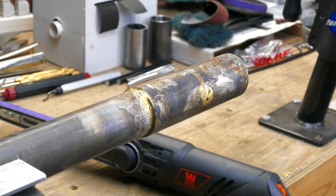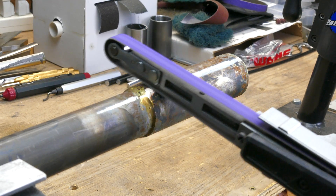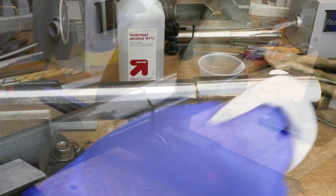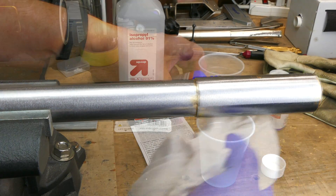For the test I found an old practice seat tube and cleaned it down to bare metal. Normally I wouldn't use a Cubitron belt to clean a tube, but since this is scrap I don't care if I take off a little bit of extra metal. After the tube gets a good shine I clean it with isopropyl and wipe it down with a clean rag.